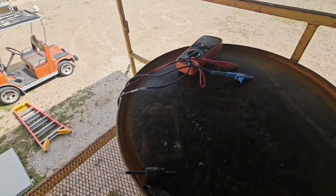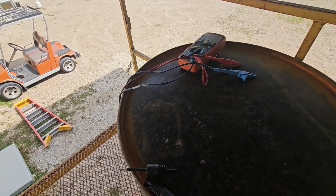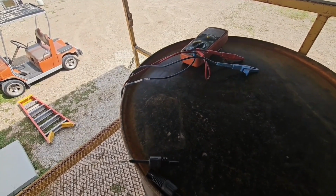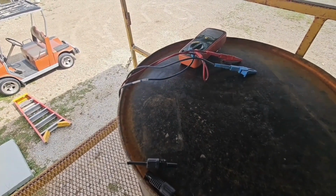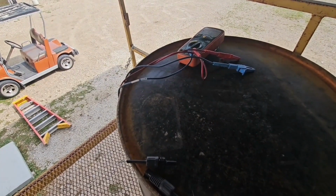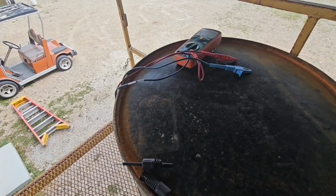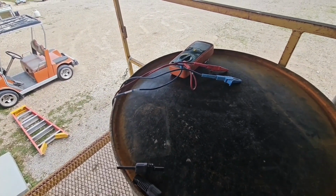You buy these panels cheap. These NE Solar 370 watt panels were $2,000 for the pallet load shipped in. And if you're taking the residential tax credit, that really gets you down to about 10 cents a watt, so that's pretty cheap. But you never know. You might get a panel that's got the pigtails or the MC4s on wrong, and you'll hook it in your string and then stand there and wonder why in the heck you're not getting much output. So I always double check everything, and you end up with a lot fewer mistakes and headaches that way. So be your own quality control.